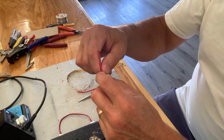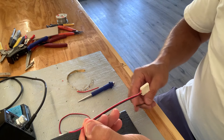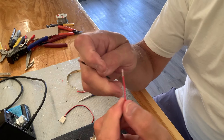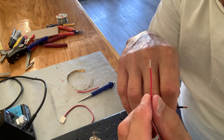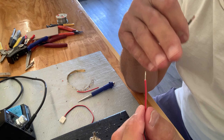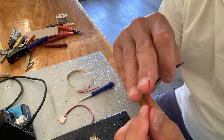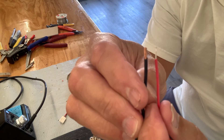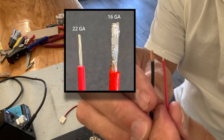So that's why we solder wires on. Another thing I'd like to address: on end pigtails or couplings, most manufacturers use a very small wire — like 22 or 24 gauge — and this is only good for about one strip. When you add two or multiple strips together you'll start losing voltage because of that very fine wire. We use a 16 gauge wire, and that makes all the difference in the current going down the strip and gives you better lighting.